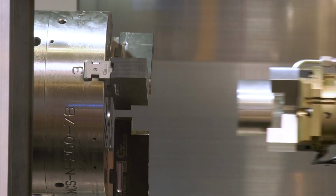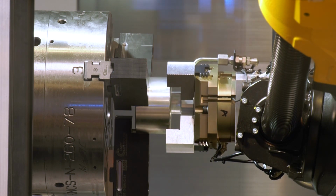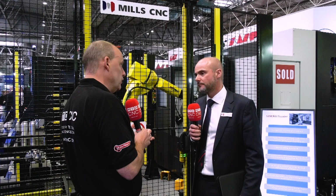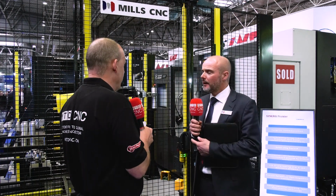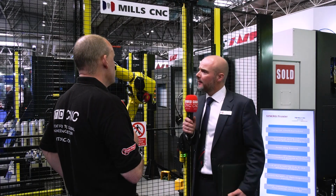And would you guess, if you measured it, and maybe from your experience, that sometimes the better return on this type of solution is for companies with lower volumes, when you consider all the costs within the manufacturing? I think possibly, because the system sets itself up for that really, for lower volume. Obviously, if you wanted real high volume, then you'd probably have conveyor belts come in and out, etc., to handle that. But this, you can load the drawers while it's running, you can change over, but I think this is more your sort of lights out, come in then the next day, change over the parts, you're good to go again really, rather than what I'll class as mass production.